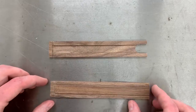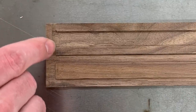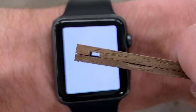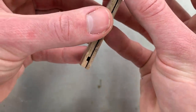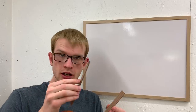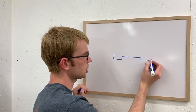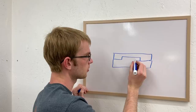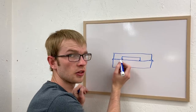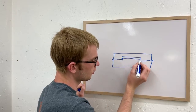This is the front layer and this is the middle layer. When I put them together, you can see the bottom of this rabbet lines up with the top side of this slot, so you have a nice clean one-sixteenth by one-eighth inch hole all the way through. You're probably wondering why I bother to make them interlock like this — why not just cut the groove in one side and glue it against a flat piece? This is something I've learned through making all of these prototypes: if you just glue the one piece with a channel flat onto another piece, you're going to get a little bubble of squeeze-out on the inside corner. When you try to slide the rule in, it tends to hang up on that squeeze-out. So instead, I make them fit like this, and that way the squeeze-out pretty much ends at the joint.